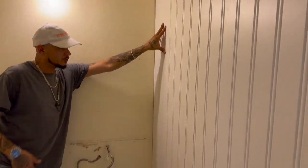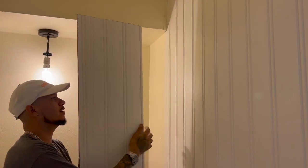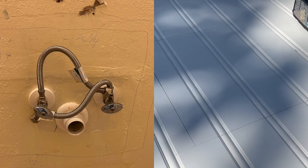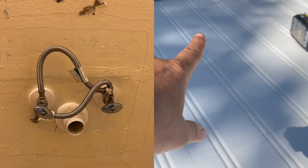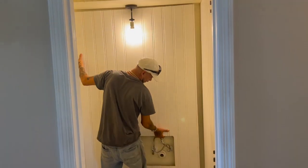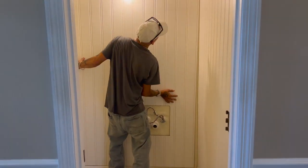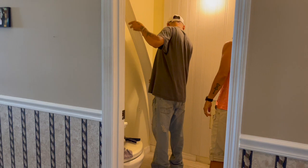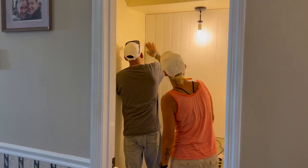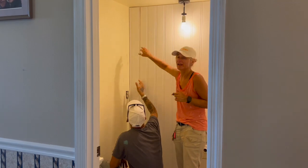We just cut and now we're dry fitting the second piece — that one was pretty quick and easy. We're going to liquid nails it and shoot it in. What we did is measure out the bathroom wall to get around all the plumbing, then drew a little square and cut that out, then cut the length off. Now we're fitting in the sheet where we cut out the plumbing — dry fitting that and getting it shot in. Now sending liquid nails and nailing it.